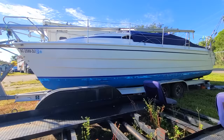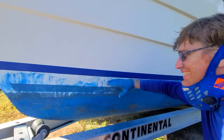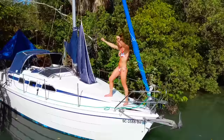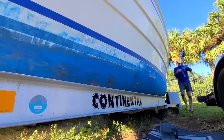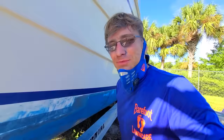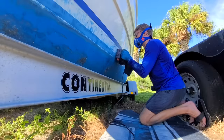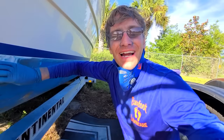Here's the mess we have. Let's have a closer look at what I'm doing here. Here's the original water line, but with so much weight in the boat the new water line is all the way up here. First time I did it I got in a hurry, scuffed up the gel coat, painted right over it - well it didn't last but three months. So now I've got to take it all the way back down to the gel coat, do a barrier coat first which is what I should have done. I knew it but I was hoping it'd be okay. I was wrong. But now it's time to do it right. It's not easy - it's 90 degrees outside, sweating bullets. We've got to do what we've got to do to have fun, keep the boat looking good, performing well, and more importantly keep the water out of the fiberglass.